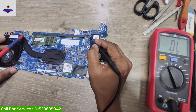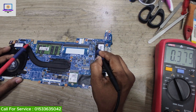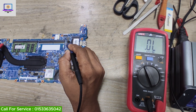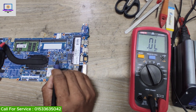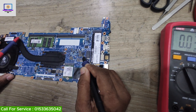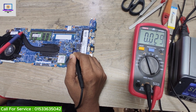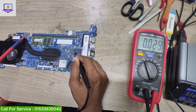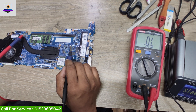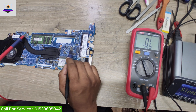After that I need to check this 5-volt power rail. When I touch here it's showing 387, so this line is also OK. Then I check the 3-volt line — this is the 3-volt power rail. When I touch here, as you can see, it's getting a beep, and it reads 0.293. This line should not beep here, so I believe this 3-volt power rail is shorted to ground.